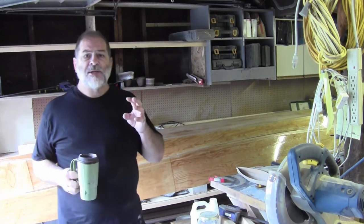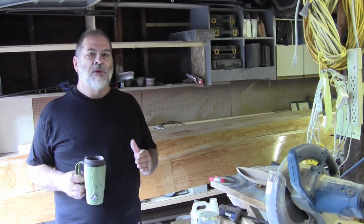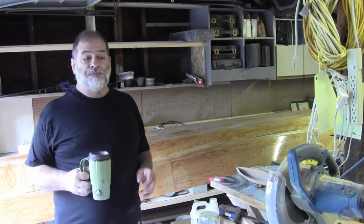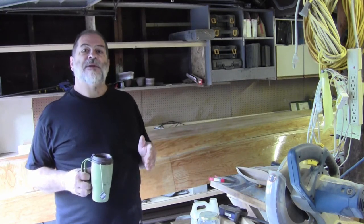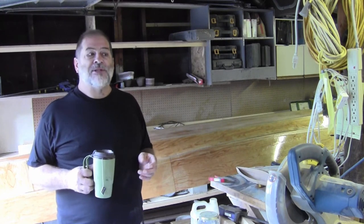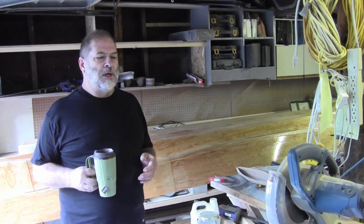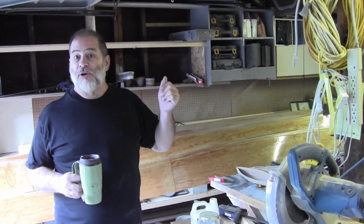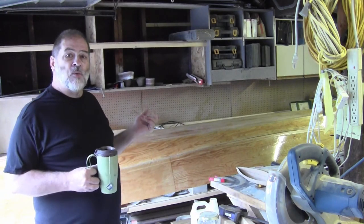And that's the thing, the epoxy, when you mix it the first time, it's almost like water. It's very liquidy. So it runs incredibly easier than paint. But within the time of your applying it, it stiffens up. It becomes like a syrup almost. Not to the consistency of a thick syrup, but a thin syrup, a cheap syrup. But it makes it harder to apply, and the coats inevitably become thicker. So speed is of the essence. Unfortunately, this type of process isn't one for speed.